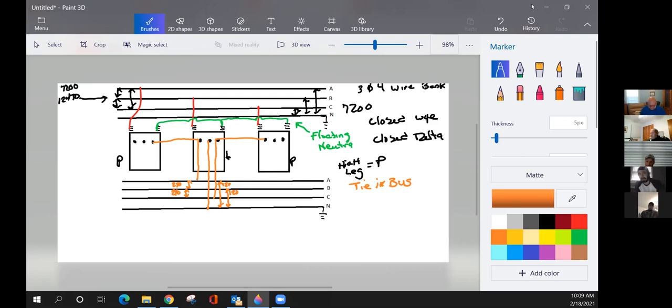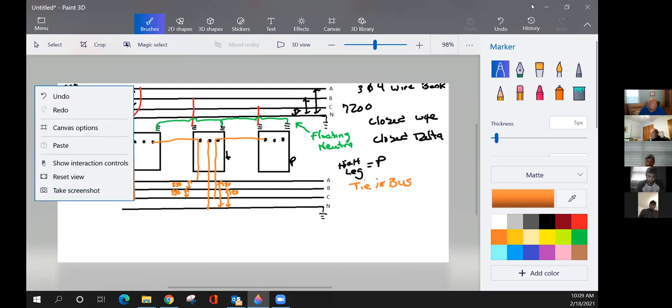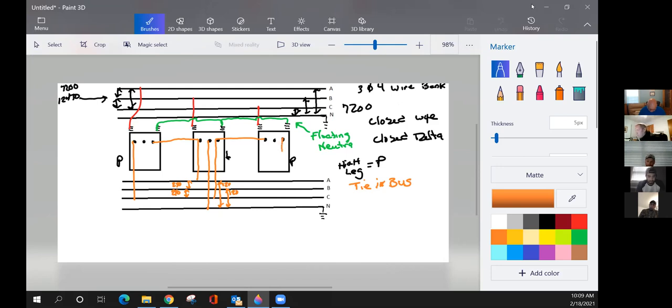So now we want to get a high leg voltage for our customer to get that three phase. They're tied, I'm sorry guys, tied here. And tied here. Notice he carries both of those leads down to the same secondary line, C. Correct. And C. Yes. Okay, guys, tell me what our voltage is from here to here? Anybody? We're looking for 120, 240, three-phase service. We've already got 240 here, and we've got 240 here. We've gone from C phase. We're going to measure our voltage from C phase to neutral. Can anybody give me a guess what that's going to be?